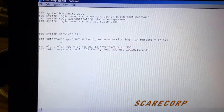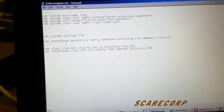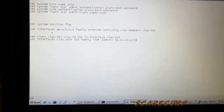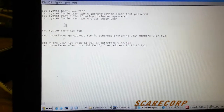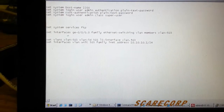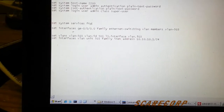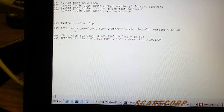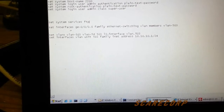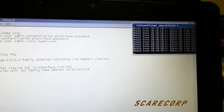There are a number of ways you can do that. This is my config — there are different configs and different methods for you to be able to ping your switch. The upgrade will be an FTP upgrade, so you'll need ping ability. I've basically put a name on it and allowed admin and root authentication passwords. You also have to set your system service FTP to be enabled with that command. Then you just need to make a VLAN and an IP on it, and then you should be able to ping your switch.